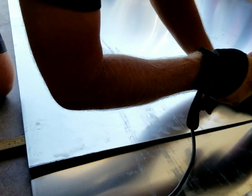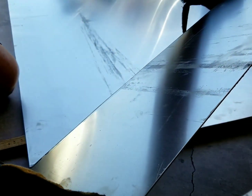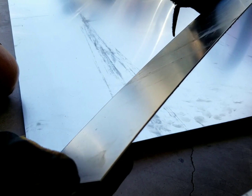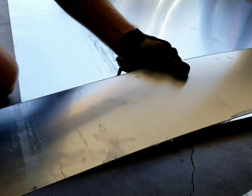I've got a little piece of wood underneath to get the aluminum up off the ground. When you cut it you're going to lose about a quarter inch of material at the blade, so I'm going to cut on the left side of the line, keeping the center right on the blue line. We ended up with a piece four foot long by seven and a half inches — just got to trim an inch off the end. I'll trial fit it first to make sure it looks right.